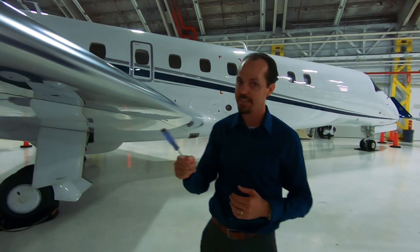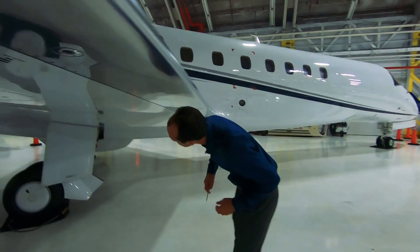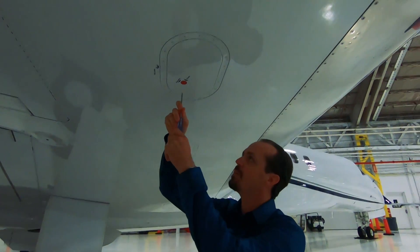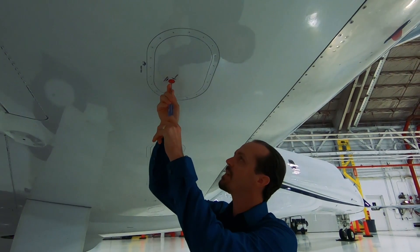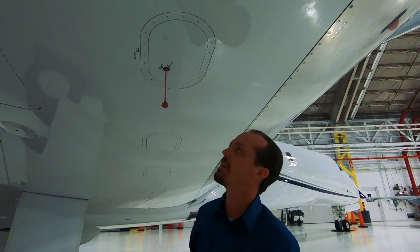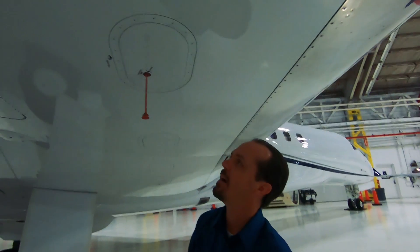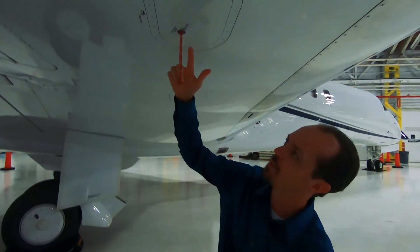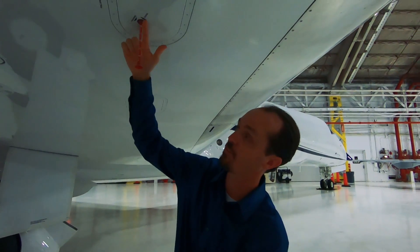So I'm gonna come under here and show you a little bit of what it looks like. We do need a screwdriver to make this happen. Alright, here it is — there's a little dot up here and it says unlocked and locked. So if we take a screwdriver and stick it in here, we drop it out, we get this little stick that pops out, and it's got these hash marks and numbers on it. Right now the tank is empty, so that's why it's showing zero.